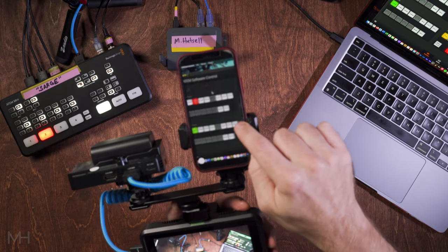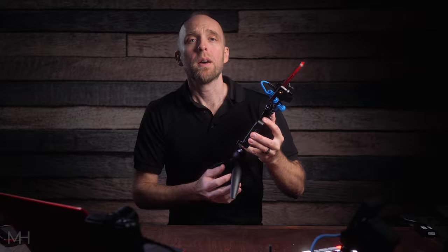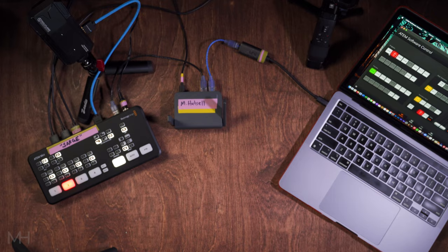If someone's looking at a monitor that's overly saturated or has too much contrast, they may ask me to make a change when the camera view is actually perfect — it's just that one monitor someone fiddled with before the show. Now some cons: most video switchers don't have a native iOS or Android app, so we have to use something like VNC Viewer. You're also trying to view a laptop screen on a much smaller phone screen, so it's not always precise and you may click on the wrong input. You may also be limited by the wireless range of your router and your HDMI transmitter/receiver kit.